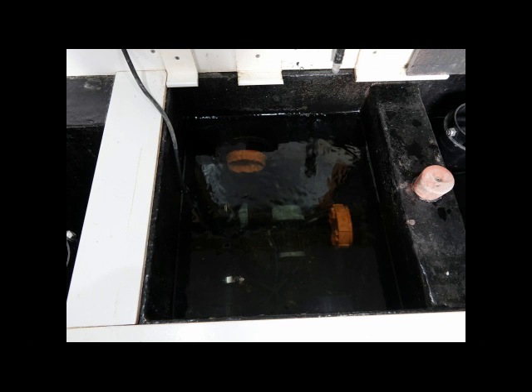From the anoxic chamber through another 4-inch pipe, we end up in the outlet chamber. In the bottom of that, you can just about see a submersible pump — that is the pump which works the water feature. To service that pump, you simply unscrew the union and pull it out; it's obviously being fed clean, filtered water, so there are never any blockage problems. At the top, you can see the 4-inch outlet which goes back to the pond — gravity fed to a directional nozzle on the end. On the right-hand side, you can see a blanked-off plug. If I unscrew that plug and connect it to the outlet to the pond, I force water from the outlet chamber straight back through to the inlet chamber, so the filter is recycling itself. If I'm doing some filter flushing and it's a bit dirty, I can recycle through the filter until it's clean and then divert back to the pond.